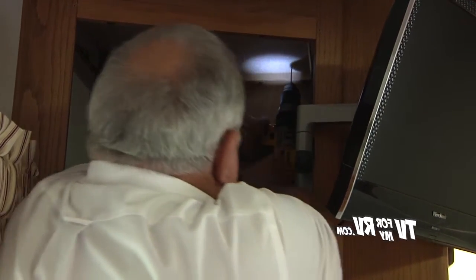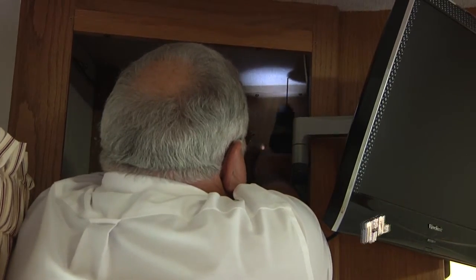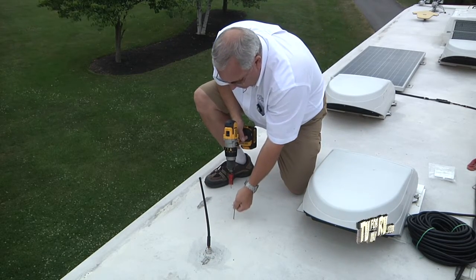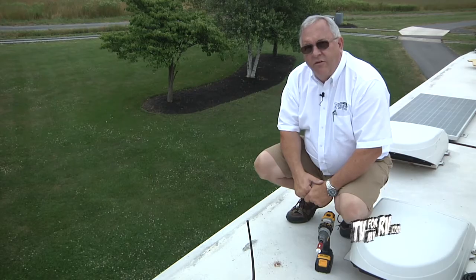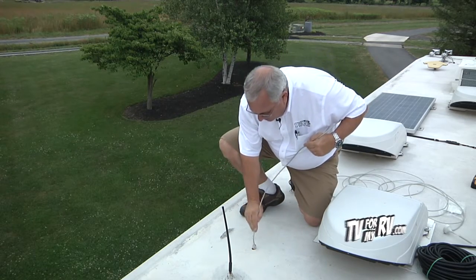We're getting ready to run the cable down from the roof and we're going to make a roof penetration going up through from inside. I like to go up through from the inside first with a very small drill bit just to make sure that when we get up top we like where we're at and don't have a big hole to fix if we have to move to a different spot. After you've drilled the hole, loosen the chuck, take the drill off the drill bit, and leave the drill bit sticking through the roof so you know where you're at when you go up above. Now that we have the hole in the outer skin of the roof, we'll drill up from the inside to reduce the amount of splintering that takes place.